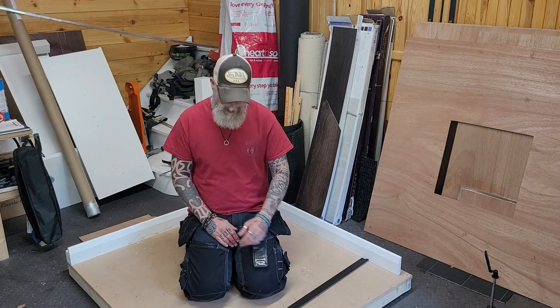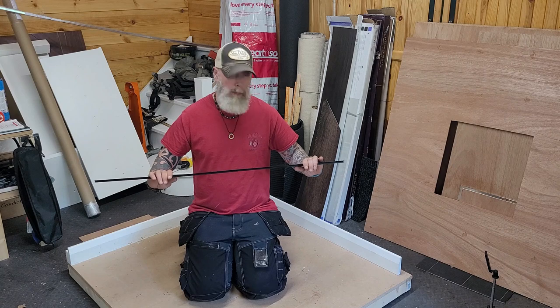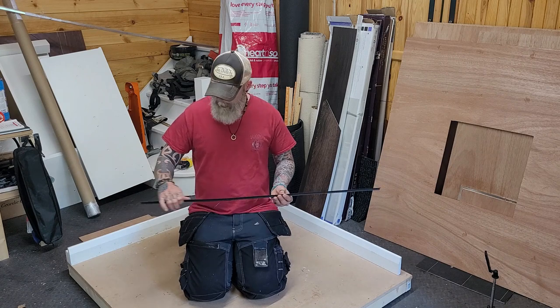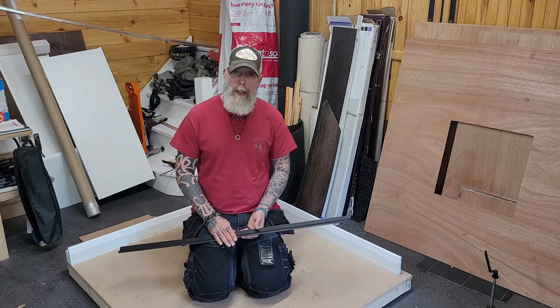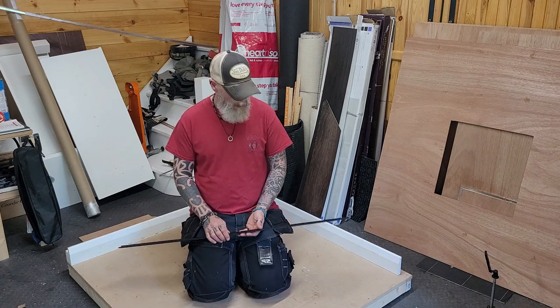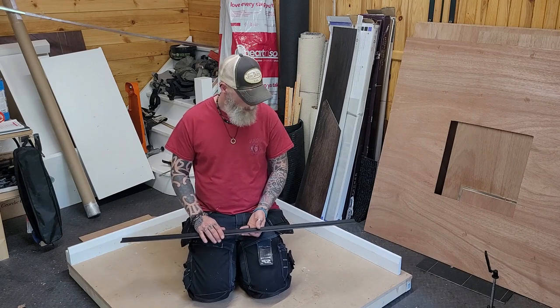The Zee Bar by Stairrods is a high quality aluminium invisible finishing profile. It's designed to be used where the carpet requires turning and tacking around open spindles, around landings, in doorways, fire hearths, or even if the room's got a beading incorporated into the skirting board.